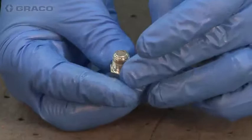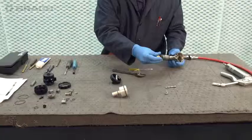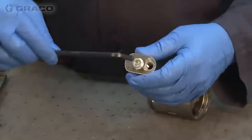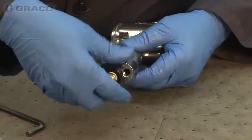If we want to change the position of the handle, we can actually move the air inlet to another port. We're going to get a quarter-inch hex key Allen wrench and remove this port. This port can move to this part of the handle — down to here. This is how we change the direction of the air inlet to the gun.